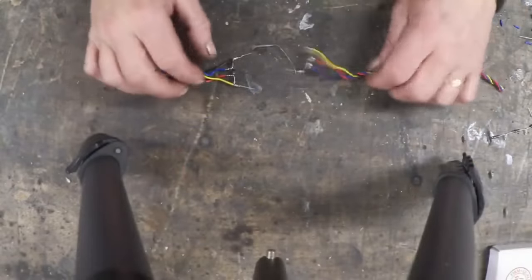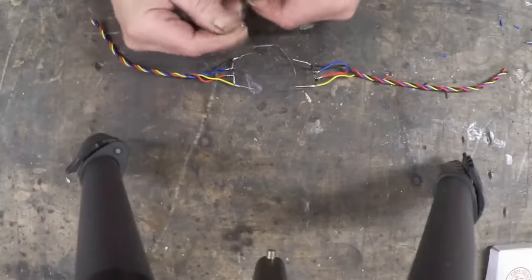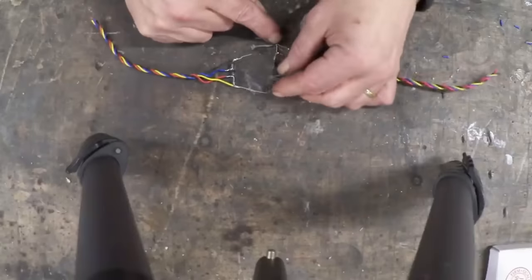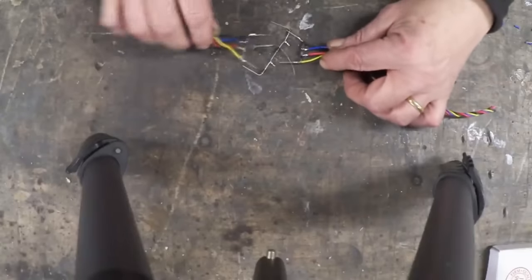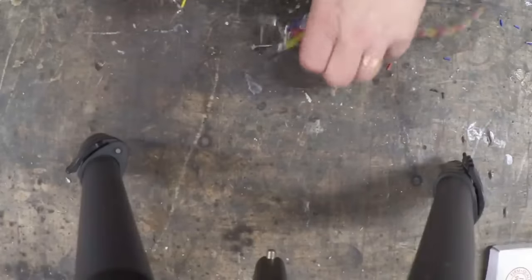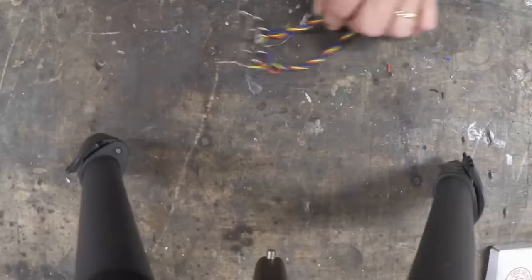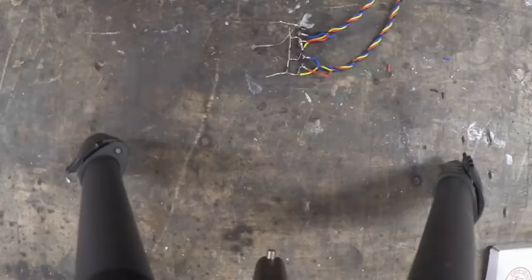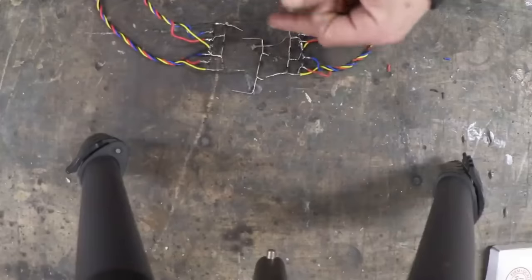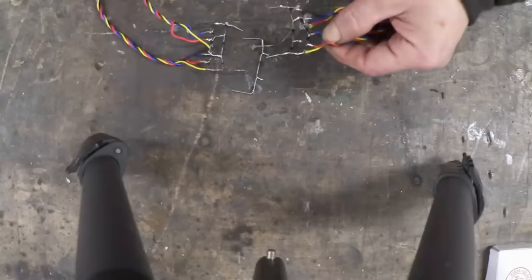Once we've made two of those, you can see they're done on the same sides — black to the bottom, yellow to the top, all the same. We need to join those up to another string of diodes, and those diodes are done in the same way: black to the bottom. We solder these on one and three, just like we did with the first capacitor, and the next one gets soldered on two and four. I put some strips of plastic in there just to separate those bare wires out. There's our strip of three — we solder the black wire to junction one and the top wire to junction three. Then the next one gets junction two and junction four.